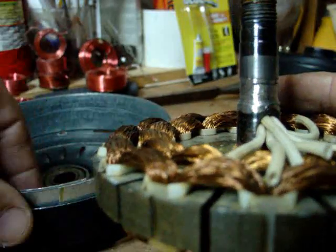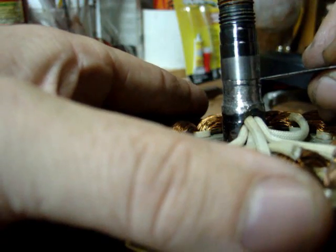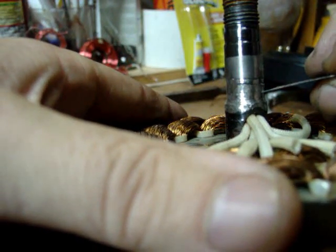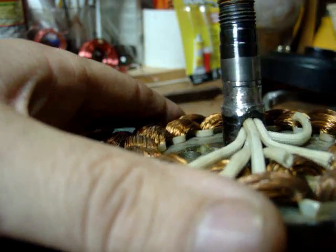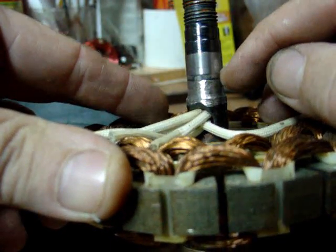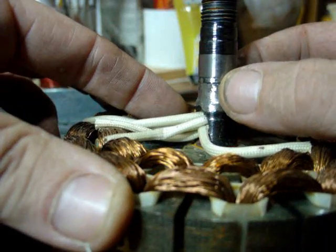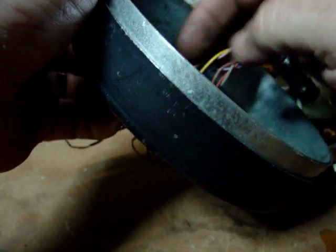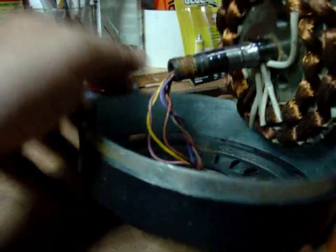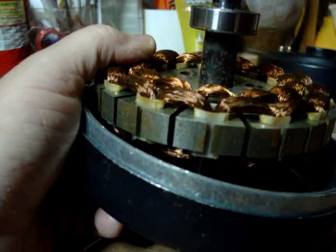If I need to make this thinner, there's an option. The bearing used to come to right here — I have ground it down to about here, and I actually went about that much too far, but that's okay. I stuck it on the bearing in the clamp and spun it as I ground down, watching and measuring the whole time with calipers to make sure it was nice and even. Then I slowly turned it and looked for the high points and just knocked them off. I'll be right back. If you want and you have enough room on this side, you can put your rectifier in here and then run wires out. I choose to do it outside the motor, where I can work on them.